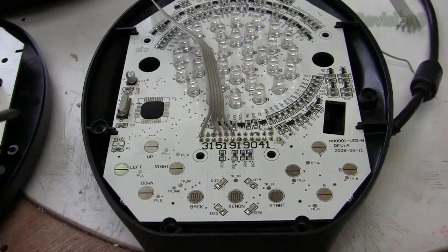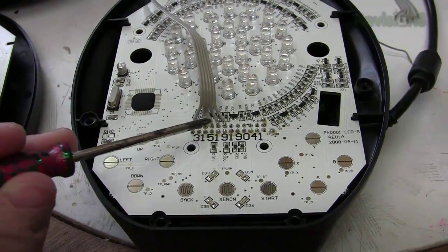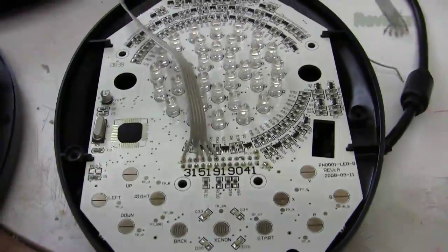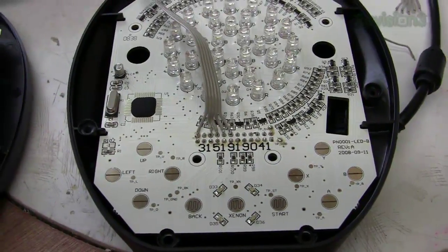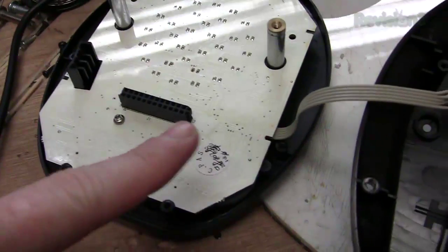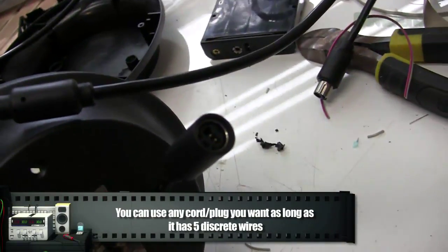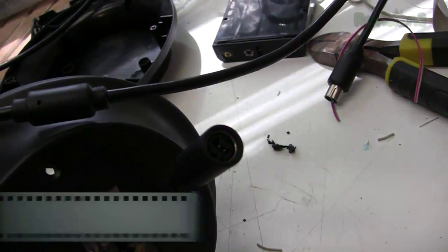Okay, well, our demonstrations have shown that you only need ground and then these 4 connections here to synchronize light kits. Now to wire them all together nicely. A ribbon cable connects the 4 discrete data signals plus ground to a plug on the back of the slave unit. This is where it will get the data from the master unit.